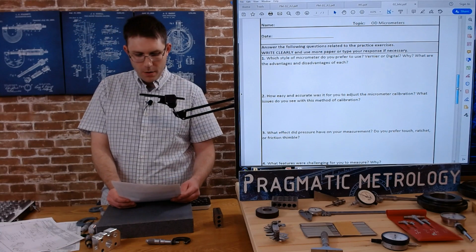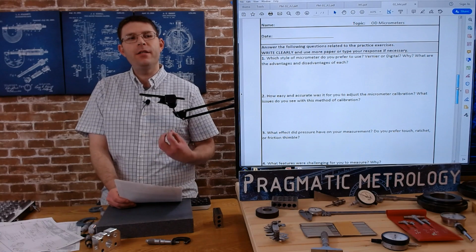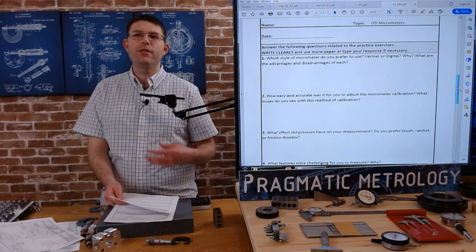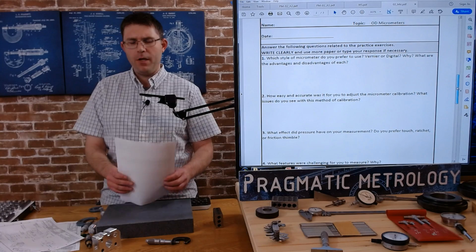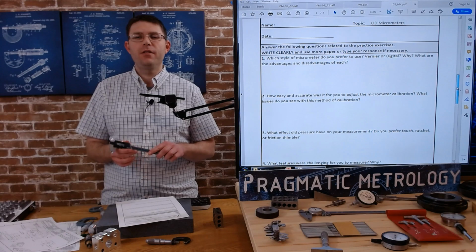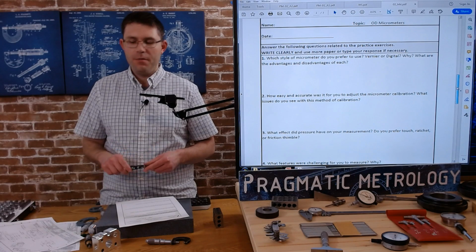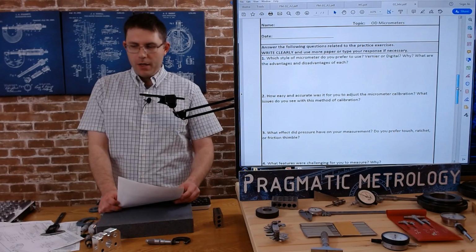What features were challenging for you to measure and why? That's something you want to keep in your mind when you go to use a micrometer: is it the best tool? Is there an easier tool? That's something you'll learn over experience. And hopefully throughout this video series, we'll show you some examples of some alternatives. I always bring up the caliper as an alternative because it's such a useful tool, but there are many other styles of micrometer out there, and CMMs and completely different height gauge setups that you could use. So just remember, always be thinking about that.